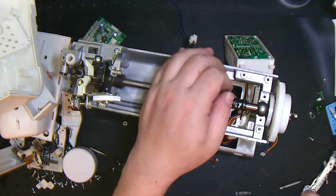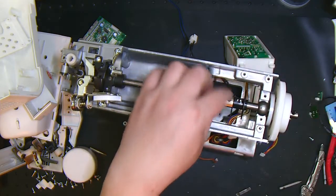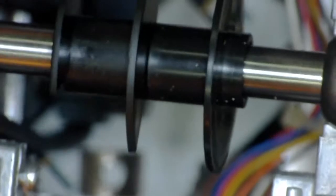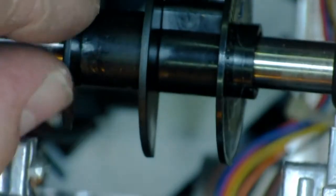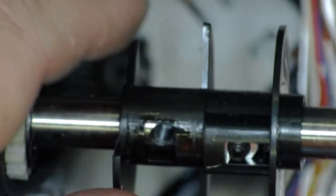All right, so a few minutes ago, I pulled apart a triple optical encoder. Here it is. And this is what it was connected to. Let's see if we can zoom in on that. So we had a triple-headed optical encoder, and here we've got the three heads. So this forms essentially some version of a quadrature encoder. I don't know what kind of accuracy this thing required, but it's got 3 gates, and those 3 combined create some sort of a code that the computer understands and decodes.